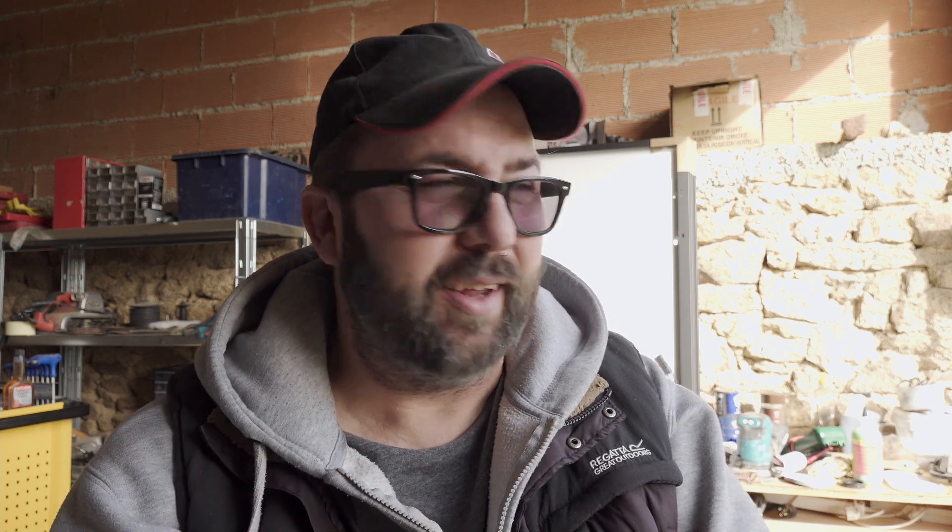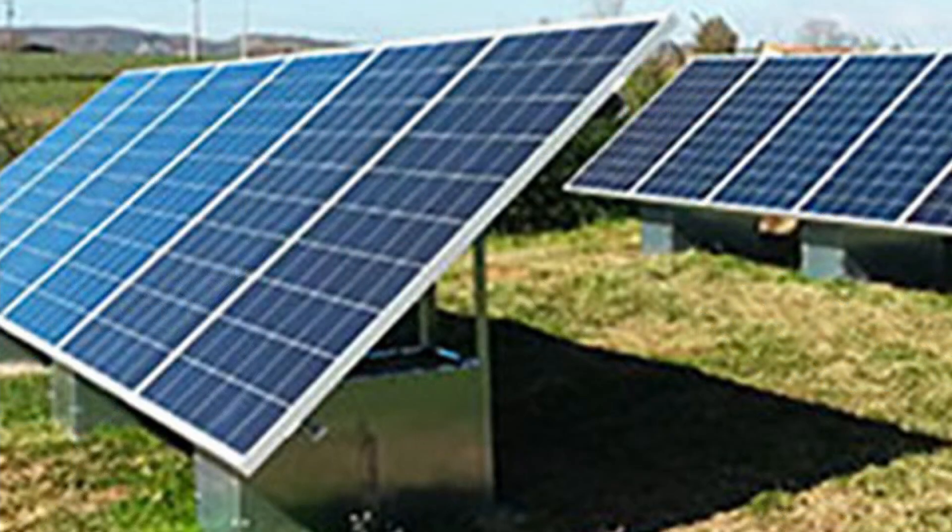But you'll never ever get full capacity. So I've opted to go for this frame. It's a modular frame — you bolt it all together. It's by GSE Ground Systems or something. I did have to order some extra pieces for these solar panels: some different rails and some different clips that hold the solar panels on. But you build up these boxes, the frame goes on it, the solar panels bolt onto that, and you fill the boxes up with ballast.